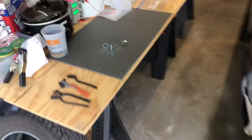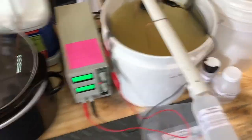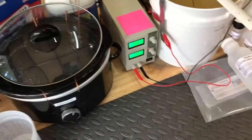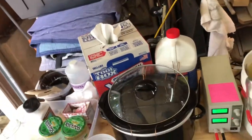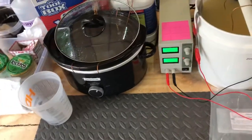It looks like a big, long, complicated process - and it is a long process - but you can get an assembly line going. You've got to wait 15 minutes in the zinc bath, so typically while that's running I'll be over there cleaning up parts and getting them into the degreaser. By the time the zinc bath is done I'll have other parts going into the muriatic acid. By the time I get those in the muriatic acid, it's time to move the zinc bath piece over, and then all the rest goes pretty quickly. You can get a rhythm going where you're really busy the whole time and not just standing around waiting.